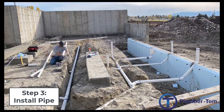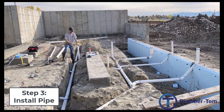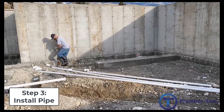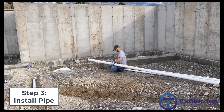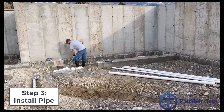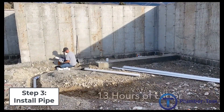We need to be conscious about the pipe and fittings that we're using so that we can make the most out of what we have. This includes storing and handling pipes so they don't get damaged — you want to be careful especially on an underground. Also, check measurements and calculations before cutting the pipe to minimize errors, and double-check that cut before you make it.